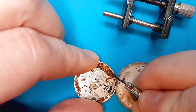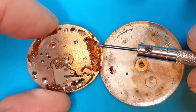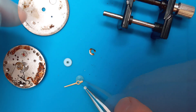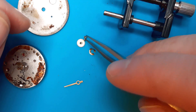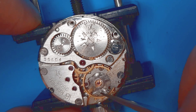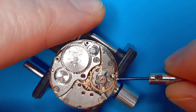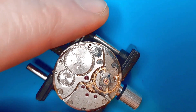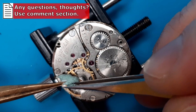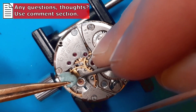Okay, so first surprise here — it seems to be some kind of glue or shellac. The first very unpleasant thing: the center wheel is broken, so I'll have to find a spare. This is the cannon pinion and the pivot from the center wheel is inside. I also see that the hairspring is totally, totally bent. It could be fixed, but I will choose the easier way — I'll put in a new one from another balance wheel that has broken pivots.